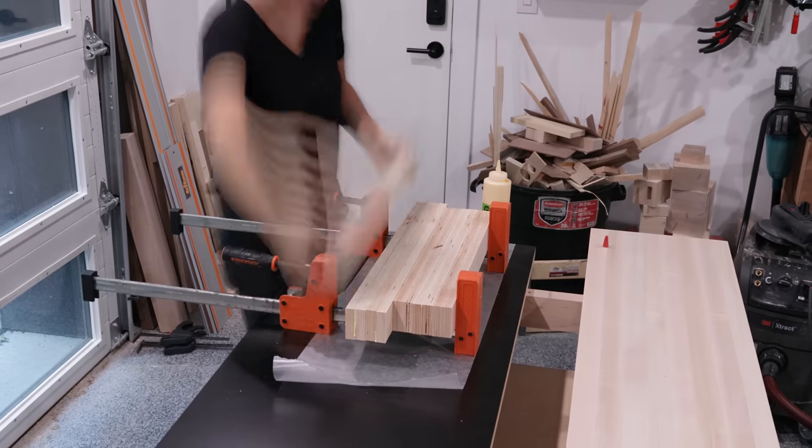I planned the order of operations here — I needed a completely flat and level surface to glue the torsion box together. That's why I made the hardwood top first; I could use it to clamp onto and make sure everything remained super flat. Glue and clamp one long edge, once that's dry glue and clamp the second long edge. When gluing these I used the spacers to make sure spacing was perfect. The MDF was bowed down on the outsides, so when I added two clamps to the outer edges it brought up those sides and it all became flat.